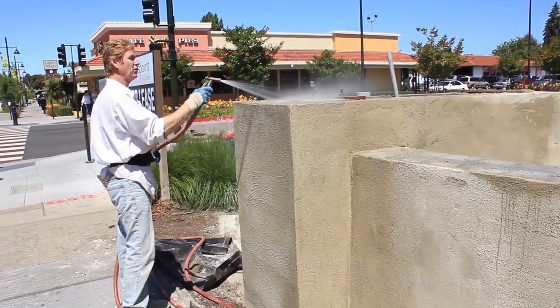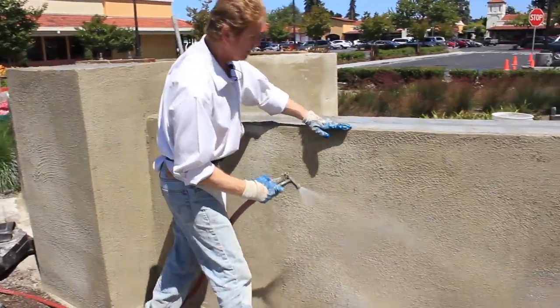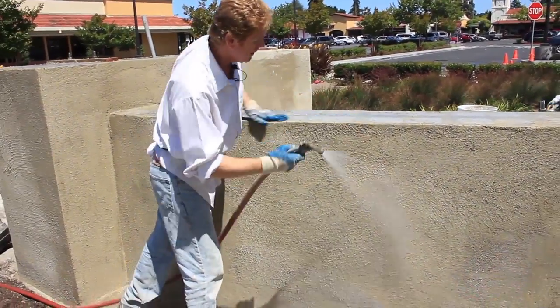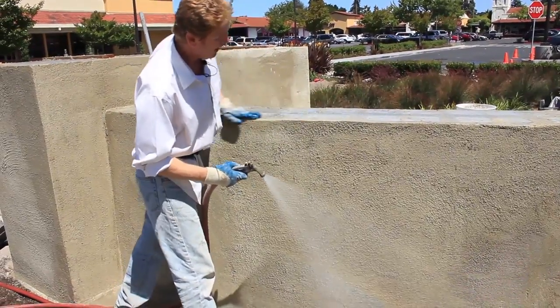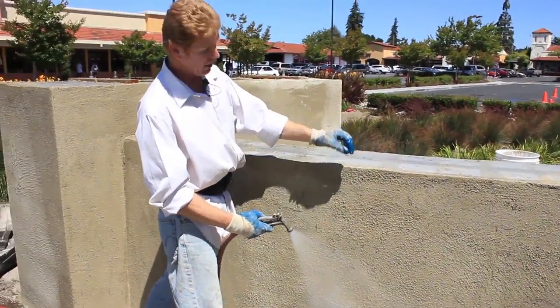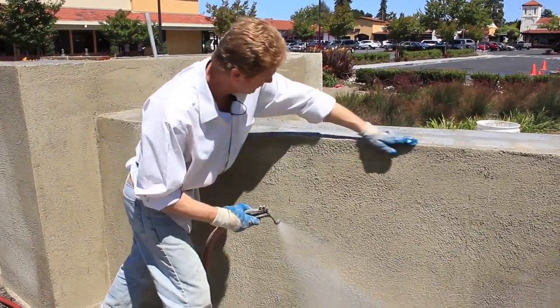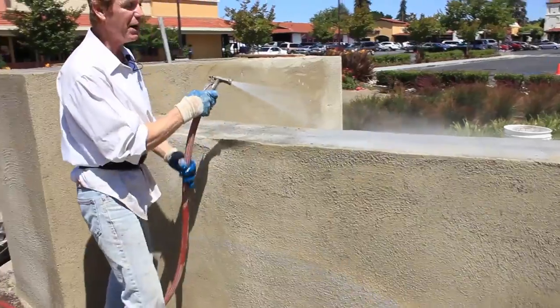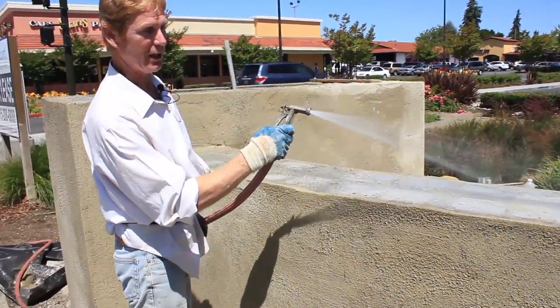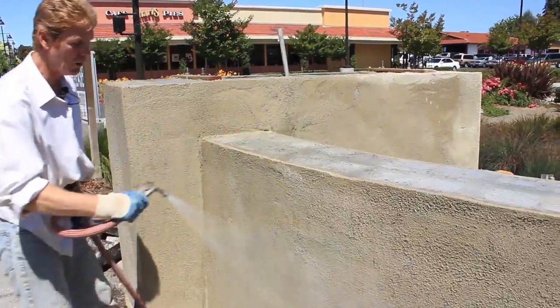when they come back to do that cap, they're gonna do a cap right here. And the cap's gonna lay on here. Now, if I have a lot of stucco that's over here and they put the cap and they push it off, not only is a piece of my stucco gonna come off, but a piece of my color coat as well. So we want this top flat. And would it be better to do the cap first? Absolutely, of course, the cap's on order. It won't be here for another few months. So that's why we're here now.